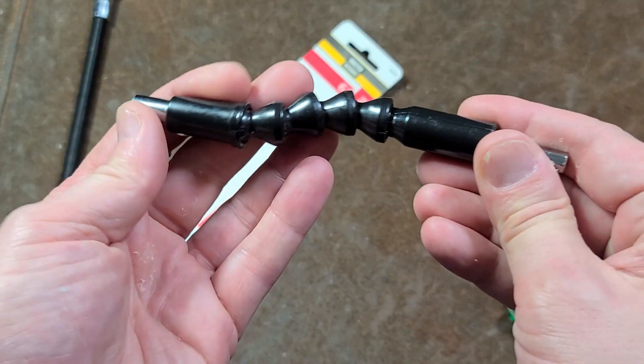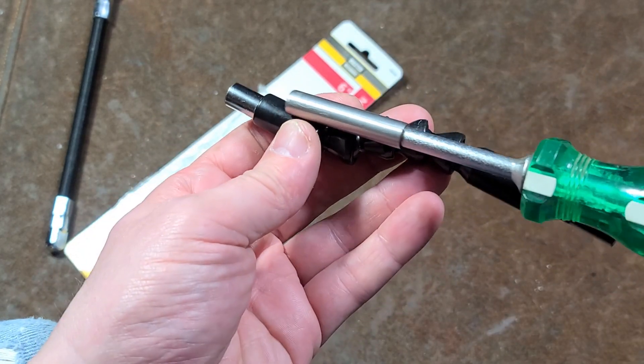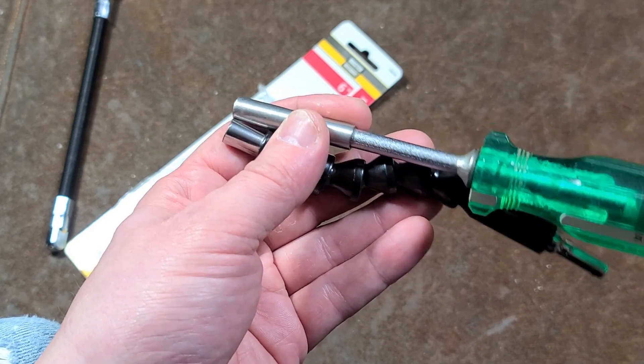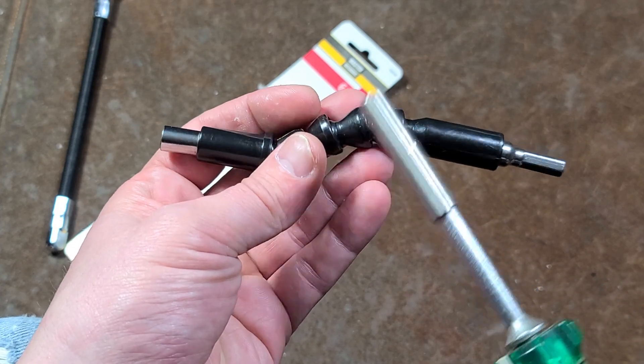You can even do a jog like this, and there's been many times where that's exactly what I needed. I had a screwdriver long enough but I'm just not able to get a straight angle against the fastener, really risking stripping it out — so using something like this could be a better alternative.